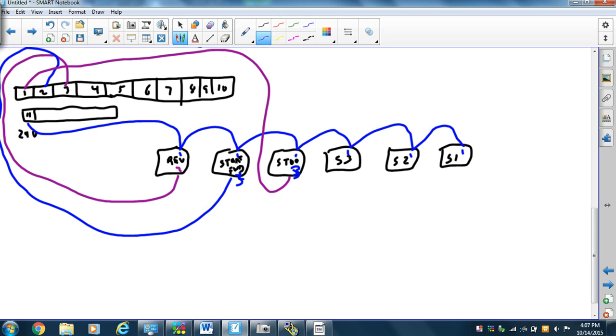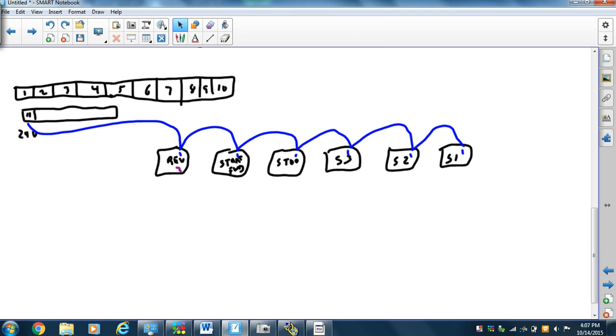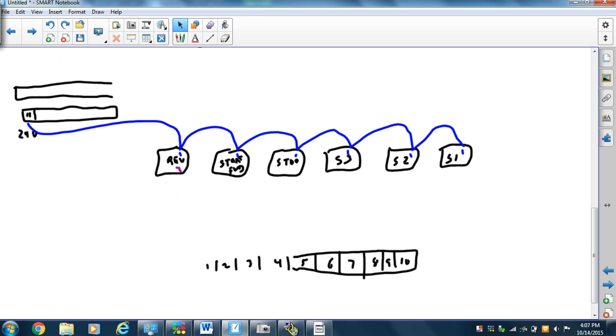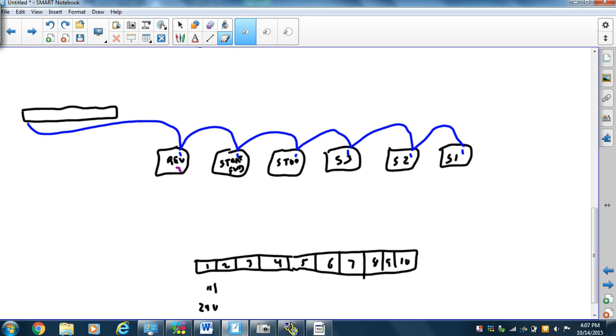So what we're going to do is back up some. And we're going to move the pins that are on the top there, and we're going to put them underneath our relays like that. And then go back and put pin 11 sitting there, 24 volts sitting there. Okay, now we're all set.